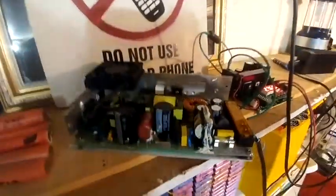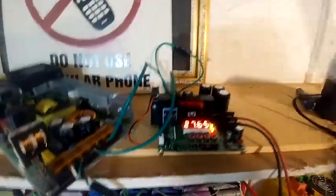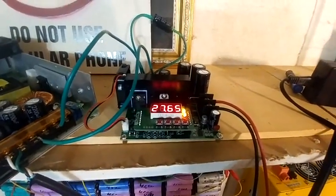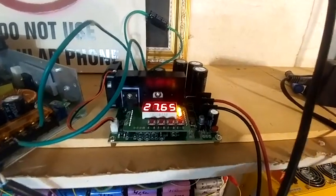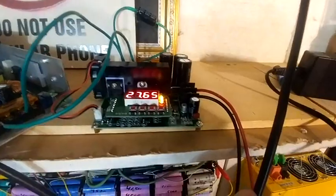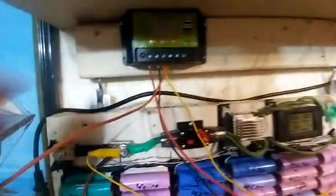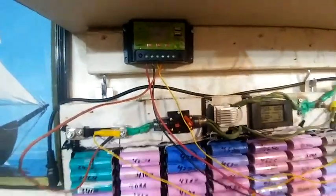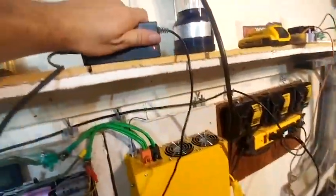Okay, I got it up and running. I've got my power supply going to my boost converter — 27.675 volts. I have it set at 30.5 volts and it drops down to 27–28 volts fluctuating. It's able to do 4 amps right now on the charge controller. That'll charge it up quickly. It's six amps total — two from this guy, four from this guy.